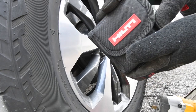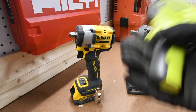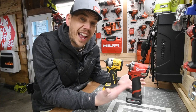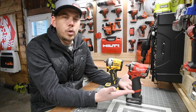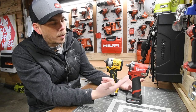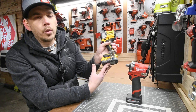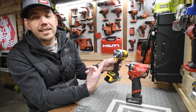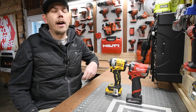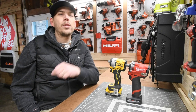I hope this video helped you. I live in northern Illinois and it is cold here — I did temperature readings throughout the video: 66 degrees for the Atomic and 79 degrees for the Milwaukee. Both of these did fantastic. This video was about a 12-volt tool with a higher amp-hour battery versus a higher-voltage tool with a low amp-hour battery. There are two bars remaining on the 5 amp-hour and still one bar on the 20-volt tool with a 1.7 amp-hour. As you can see, it's still going — that five-eighths-inch lag just drained the battery. I hope you found this video helpful and entertaining — please like, hit the bell button, and subscribe. This is Dave Nicholas, thank you for tuning in, I'll see you guys next time.